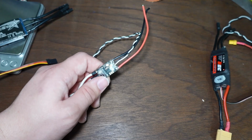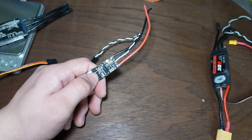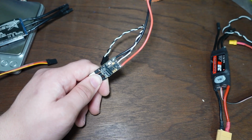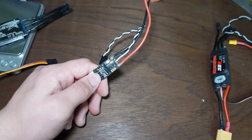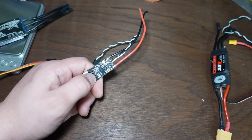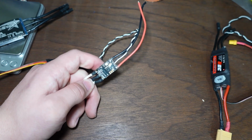But also keep in mind that with motor loads, they're almost never continuous loads anyway. I mean, with your drive system especially, you're pretty much constantly ramping up and down the throttle on each wheel, and that actually creates current spikes that are in excess of what the motor's rating is for a continuous load, but they're only for fractions of a second, so usually it doesn't really matter.